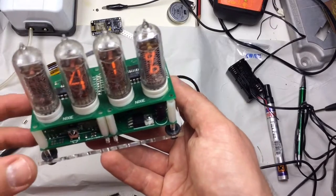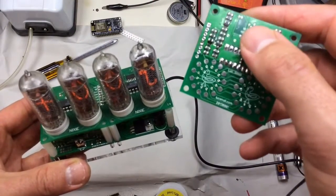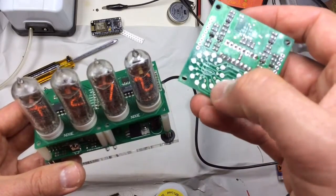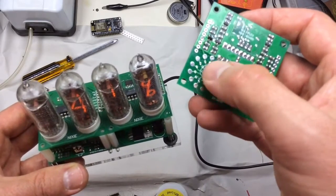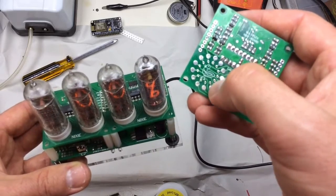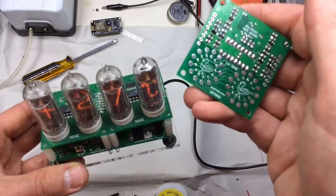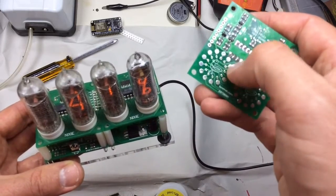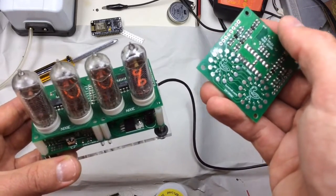I showed a simple trick for designing circuit boards that can ease replacing those troublesome broken Nixie tubes — by using flat pads to actually solder it down and just using the through holes to take the wires through without applying solder to them. That just means those through holes remain free of solder. All you need to do is cut the wires between the flat pads and out drops the Nixie tube, ready to be replaced. It keeps solder out of these through holes, because it can be really hard to remove solder from a hole that's been through-plated.